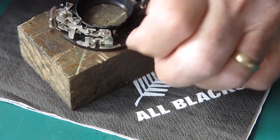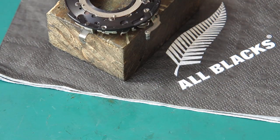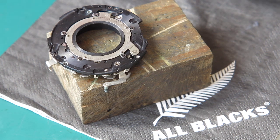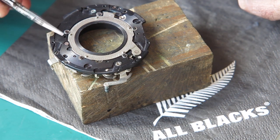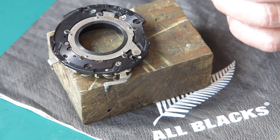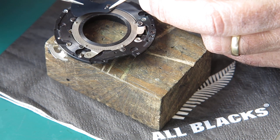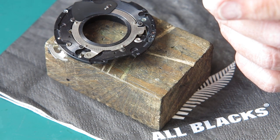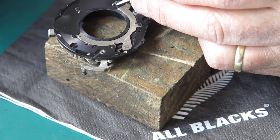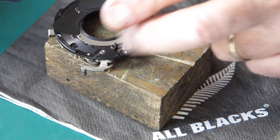So if I bring this into the cocked position, disconnect that arm, slide this forward, this puts my blade actuating ring in the blade's open position, and now I can put my shutter blades back in place. Fortunately, I'd marked my case where they were all to go, so I happen to know that blade number one goes here. And the blades are going in the blade's open position. Blade number two goes here. I could just as easily have made a sketch of where the blades were to go to start.